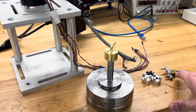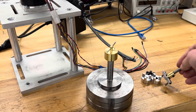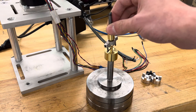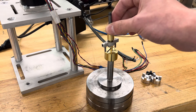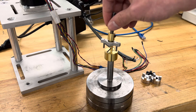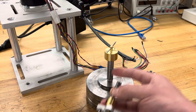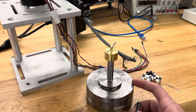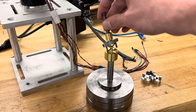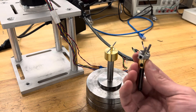It's essentially perfectly non-influencing. This coupling has zero stiffness in five degrees of freedom, but very high stiffness — at least as high as the Hertzian contact stresses allow — in the direction of interest. The key drawback is it has a very high amount of backlash, so this only works if you're trying to drive something in one direction under some sort of constant load with this very high degree of decoupling.